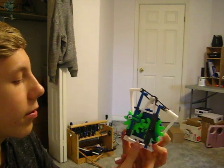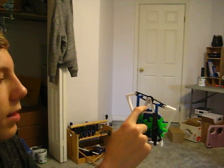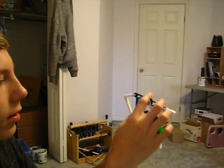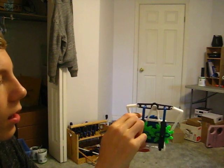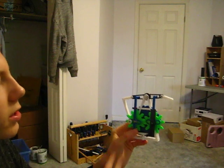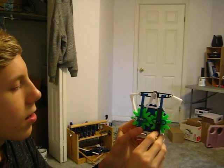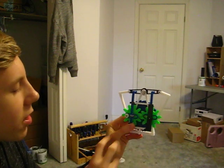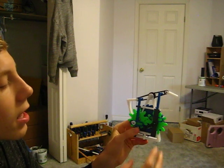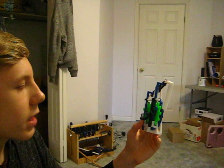How I designed this was interesting too. I just wanted to make the mechanism that has a rocker arm and the ratchet wheel at the back. And I was like, I need something to move this rocker arm up and down. So I came up with a scotch yoke. And then I was like, a good way to connect the two scotch yokes together was a gear. So it started with a simple mechanism and turned into a few mechanisms, which is kind of interesting.